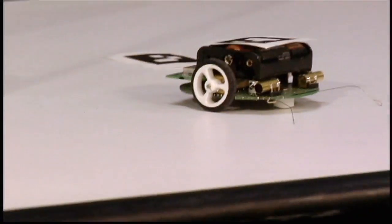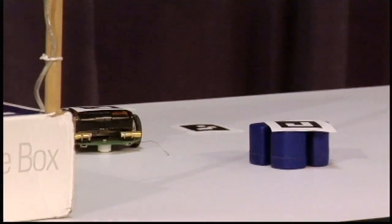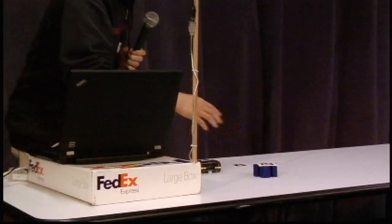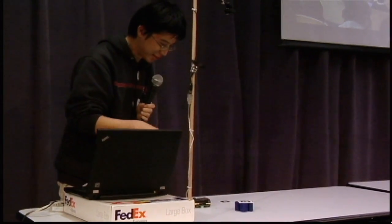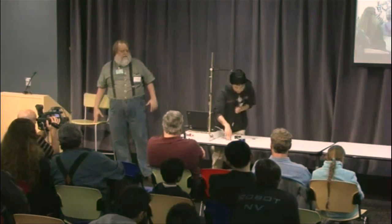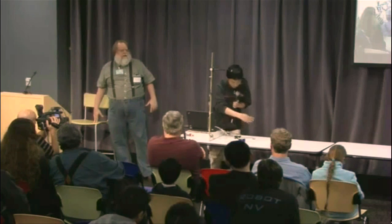Okay. Hopefully, it's okay. One of the biggest problems was trying to figure out how to get the robot behind the ball without hitting it while going straight to that point. And I determined that by finding the correct place behind the ball and two places 90 degrees away from that, and going to those first as waypoints, then going to the place behind the ball so that you can hit it.